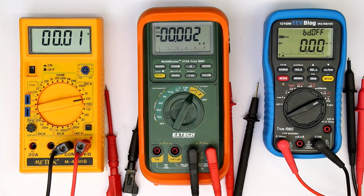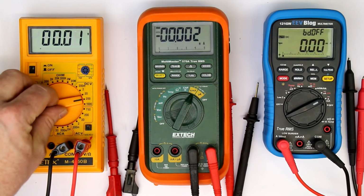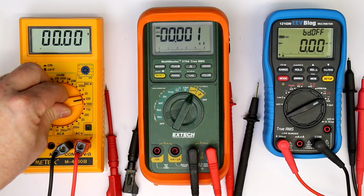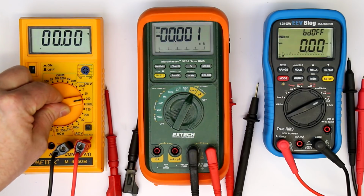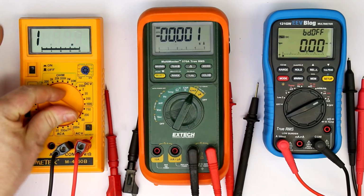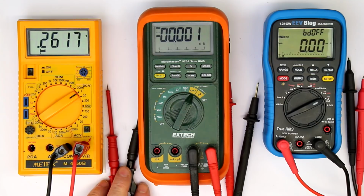And the other fault mode is of course over voltage. And the protection for that should be for all ranges, not only when you're accidentally probing something in the thousands of volts region. And not only is your DC and AC volts range then protected by any kind of means, but also if you have accidentally a voltage present and you're in the ohms mode or here in the frequency mode, etc. So there should be a high voltage protection.